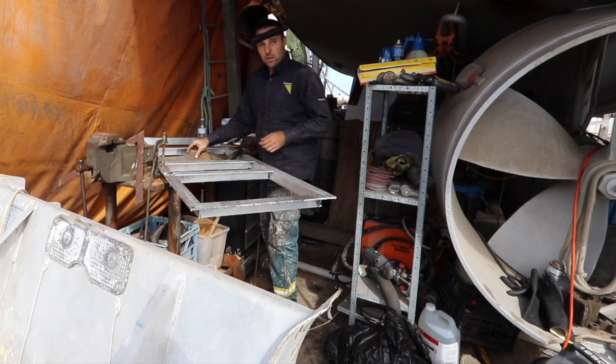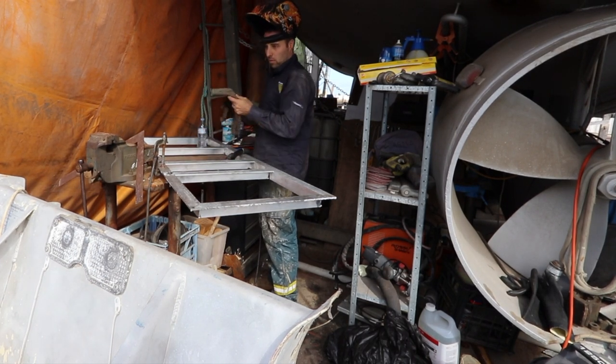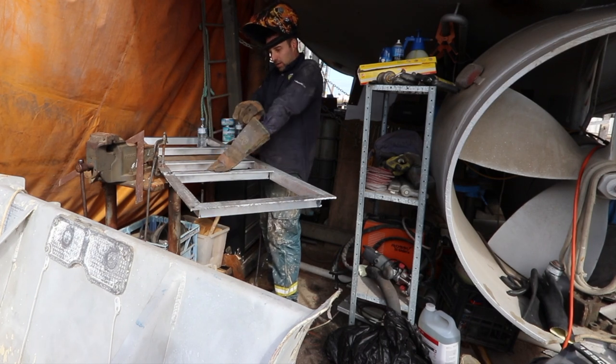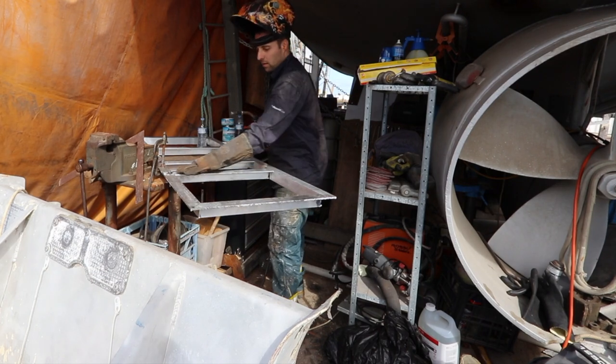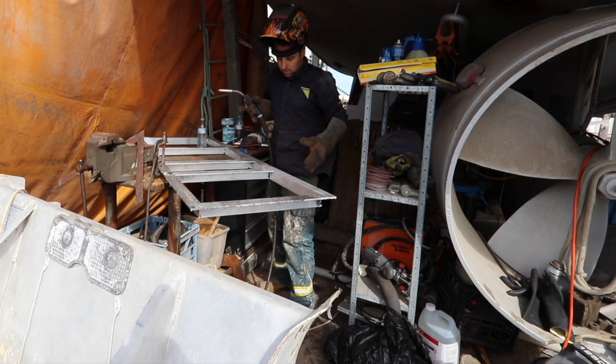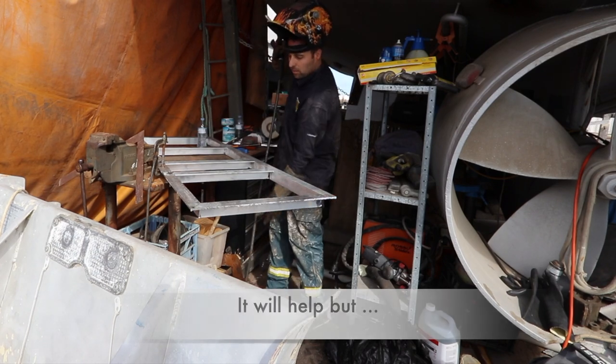So I've rebuilt the various parts on it, buffed out all of the gunk from the wire wheel, like the little rollers, cleaned out the tip, cleaned the liner out. Sort of done everything I can think of to get it to work. Straightened the run out, moved the welder and straightened that out even more, and that seems to have made a bit of a difference.